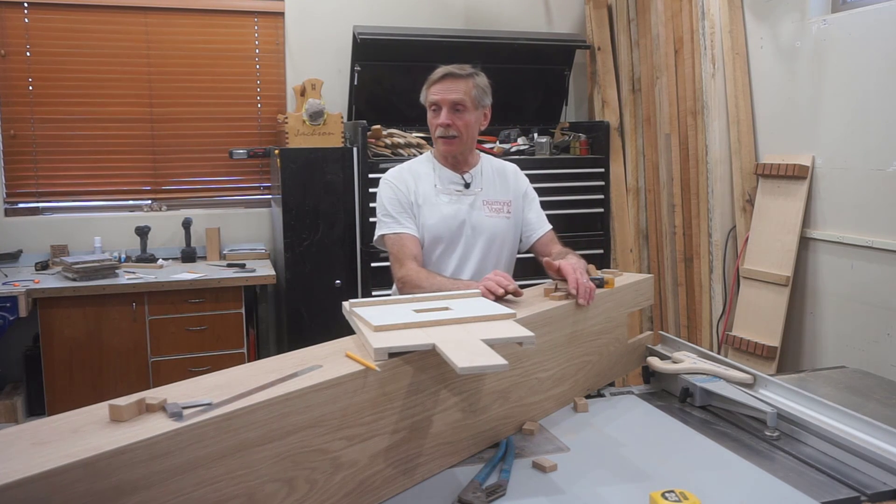With the fixture fit snugly I'll tap it into place so that the shoulders of the tenon line up with the fixture. The length of this tongue is a little bit long and that's okay — the whole function of this template is to quickly and easily trim the tenon to fit the mortises. The shoulder is off slightly too, barely a sixteenth of an inch — not accurate enough for the final fit but plenty accurate for using this template. With the template firmly in place, I just mark where the final cut will be, then remove the template to leave marks behind.